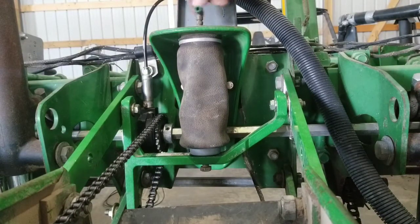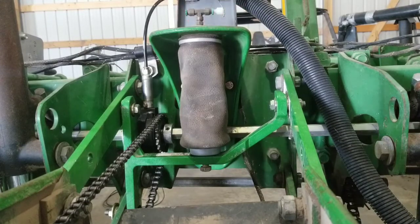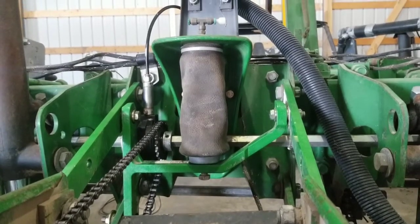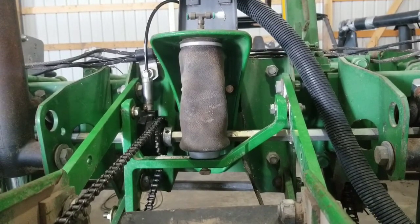A little bit about leaks and how they're going to play a factor here. Because I'm not running the John Deere factory pneumatic down pressure, it's not going to automatically refill these bags for me as the day goes on. It's going to be an old school fill-dump valve situation. So if the air leaks out every two or three hours and I have to get out and refill the bags, that's going to get old. Keeping this system good and tight is going to be very important. I'll tighten down those two bolts and repeat this times 10 more, then we'll get into the plumbing.